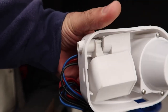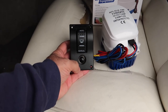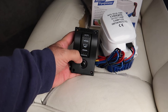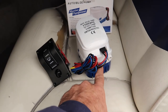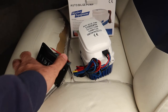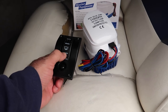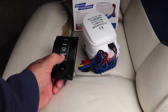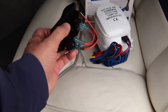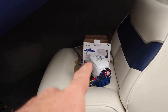There's the float, and here's where the pump sucks the water. There's your switch: on auto, when the float switch comes up to a certain level, it automatically triggers and turns on the pump. Or you can use manual — it's a momentary switch, so you press and hold it to trip the pump. It's an all-in-one unit combined, which is nice. There's also a resettable fuse right here. Let me show where I want to place this thing.